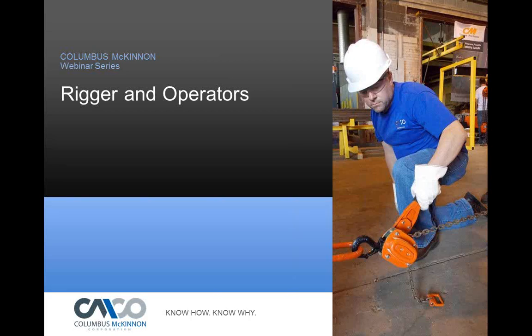Hey, Peter, really quick, what ASME standard can be referenced for sling inspection and use? Yes, that would be ASME B30.9. So we have OSHA's law, and ASME B30.9 is the sling inspection that ASME covers, and that's updated every 3 years, so it's more up to date than the OSHA standard. Okay. And a new version of that is coming out this year. Okay, great, thanks.